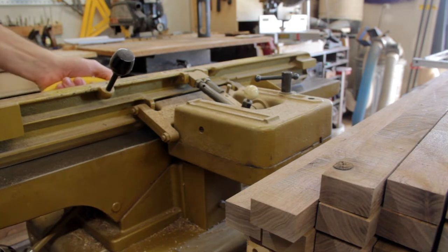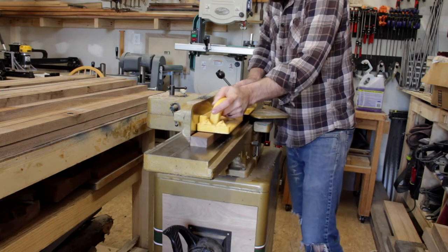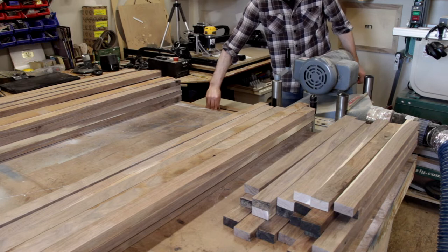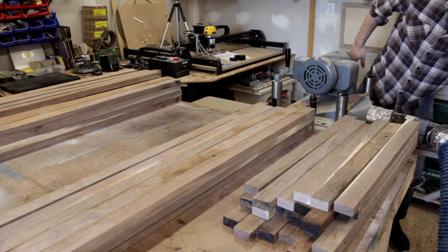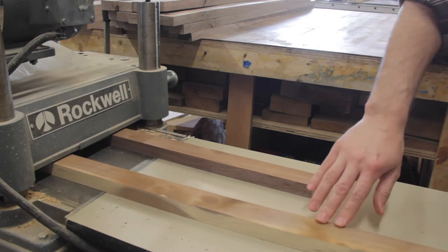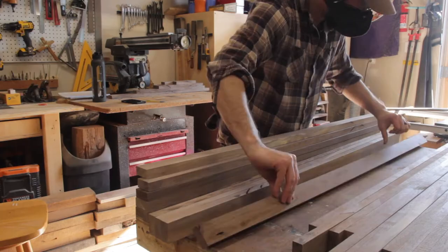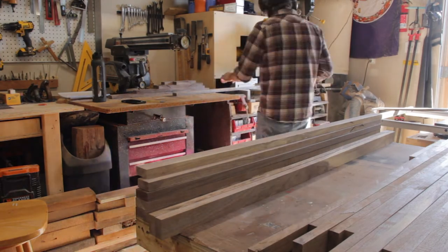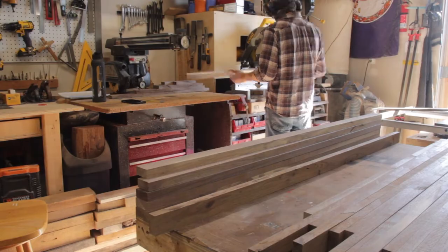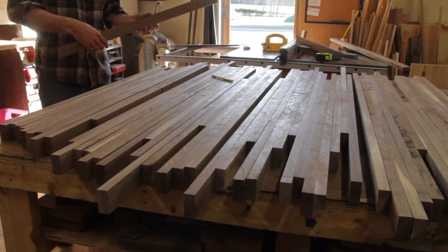Anyway, it's about saying yes. Now, real quick — with this project, why wouldn't I just leave these strips at their full lengths? I mean, that would be a whole lot easier to glue up. What I wanted to do was to avoid having any knots or cracks or voids in the top of the cutting board. So wherever there was a knot or a crack or a void, I would cut that piece out and then join those small pieces together, making those little seams that you see so often in butcher block cutting boards and countertops.